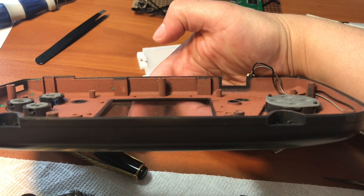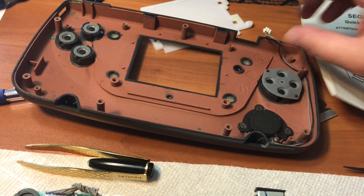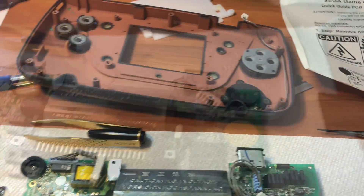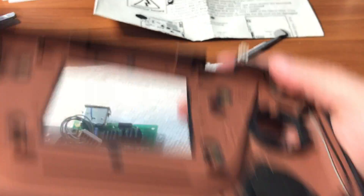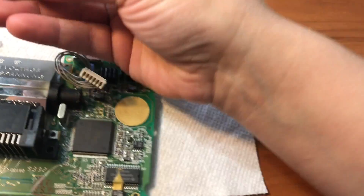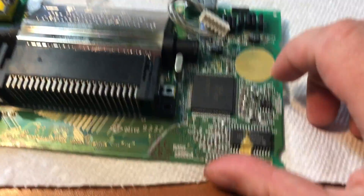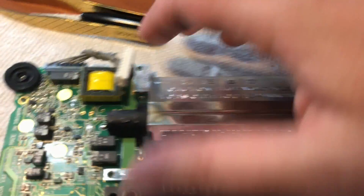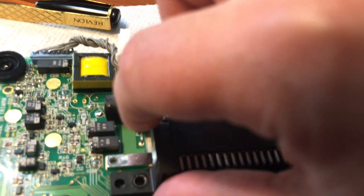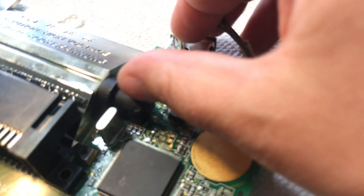Word to the wise: when you're working on it, be careful that you don't screw up the speaker wire because that's what's here. Here is the housing, and there's where the stock used to be — it sits nice and flush now. Now we have to remove the CFL lamp that's here, and the fuses FU1 which is under here, and FU2 which is underneath here.